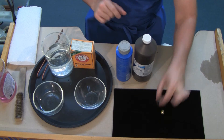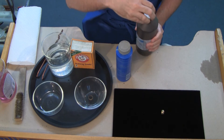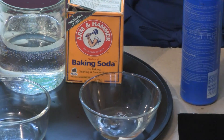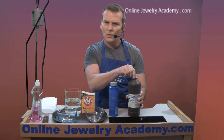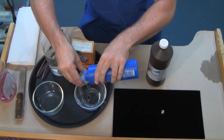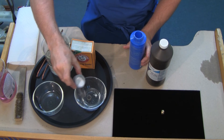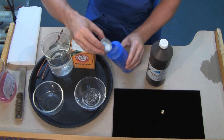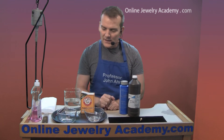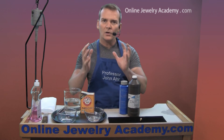What you need to do is take your dirty piece of brass and put it into a container. Then cover that object with the 3% hydrogen peroxide — you don't need more than that. Then take a little bit of the sodium bisulfate. All you need to do is salt the water, or salt the hydrogen peroxide. Immediately you start to see the brass piece look as if there are small bubbles forming all over the surface of it.